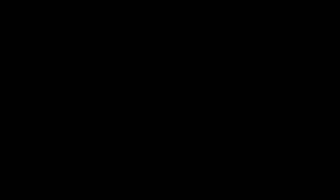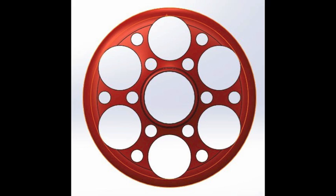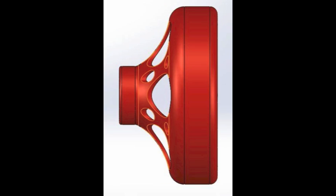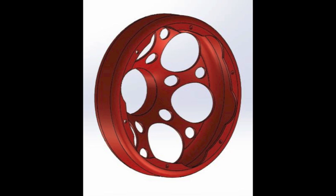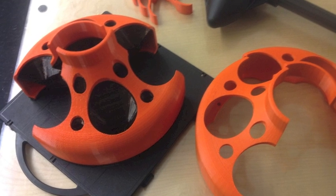In order to first make the motors usable, we had to cut off a lot of the shaft length connected to the motor. Then once we cut that off, we had to waterproof the motors, which was probably one of the more difficult steps — and it's how we lost one of the motors. We had to first put a cork made of polystyrene down the shaft below both the holes we drilled in it.